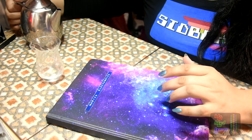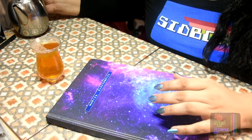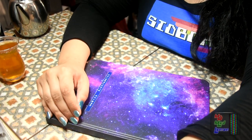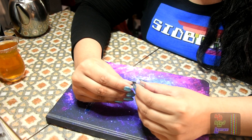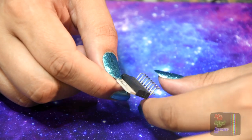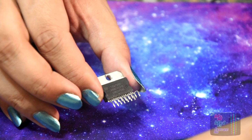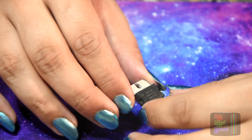Hello and welcome. Today we're going to do the power amplifier side of the sick boombox project, and to be honest it's going to be fairly easy. I've built a crude power amplifier before when I first started my channel about five years ago. To make things more efficient, I've decided to use the TDA7297 — or as I like to call it, the 'tada 7297' — which is mostly a complete amplifier needing very little external components. It's 15 watts RMS per channel, stereo, so let's build this and see how it sounds.